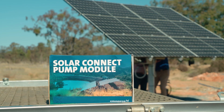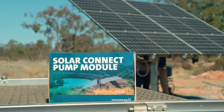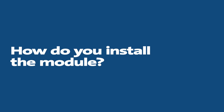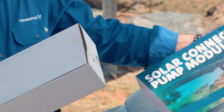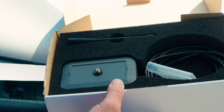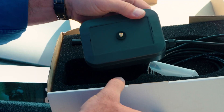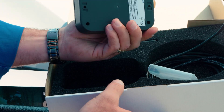The Grundfos Solar Connect is fairly easy. The box comes with pretty pictures on the outside so you can see how it's meant to be installed. If you can put a TV together, you'll be able to put a Solar Connect together. It's a little module that just needs a few tech screws to go into the solar panel, some cable that runs back in, and then predefined terminals to wire into the control box. You just need some basic tools and in no time you can have it installed and operational.